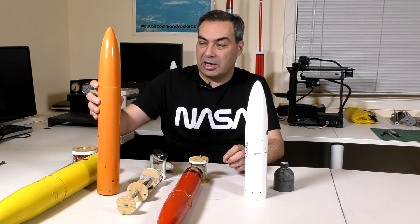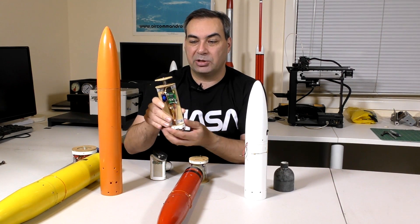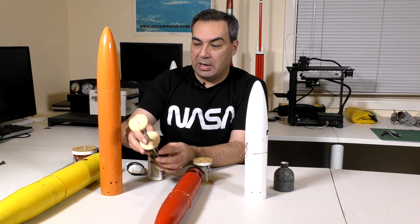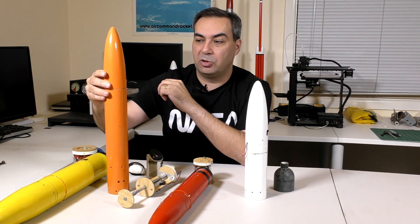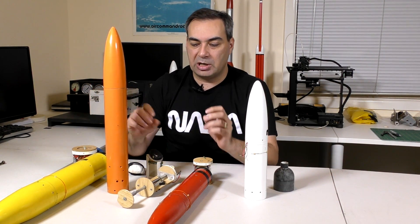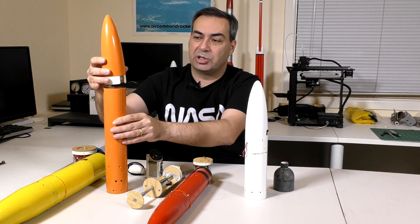Let's have a look at the first Shadow deployment mechanism that we made. This is a few years old now and it used the traditional push mechanism that would push the parachute out off the top of the tube. The parachute would be loaded inside it and then a servo motor would activate and push it out, pushing the nose cone with it. One problem was that the nose cone had to be friction fitted into the top of the tube. Depending on the weather — high humidity or different temperatures — the tube would expand or shrink giving different friction. To ensure the parachute comes out you need a strong enough spring to overcome the friction, but if the friction was too low there was a real danger of drag separation. So that wasn't ideal.